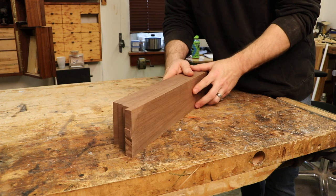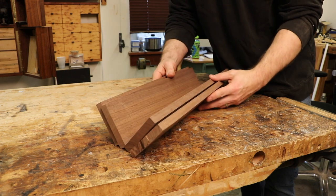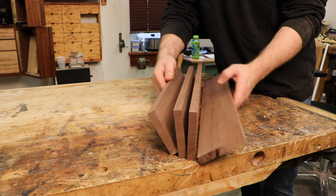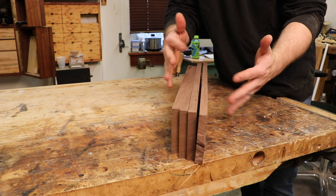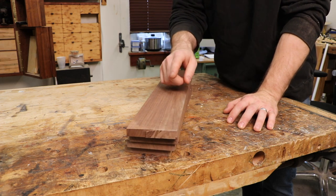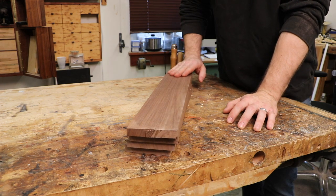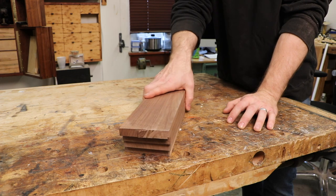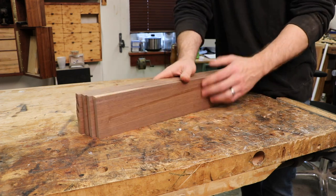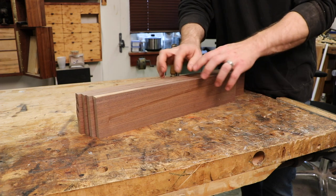All right, so first things first, I have my boards cut to rough size and rough thickness. And so now, out of that big log that you just saw pictures of, I need to do a few things. First off, I'm gonna surface plane these with a hand plane to make sure that they're nice and crisp and all of the machine marks are off of them. Even though they're subtle, I want those to go away on all edges.